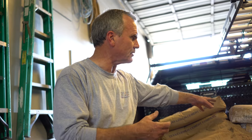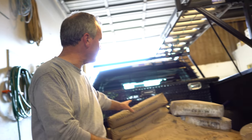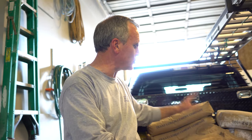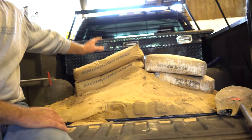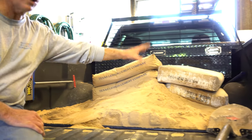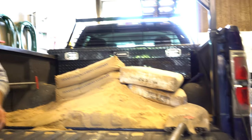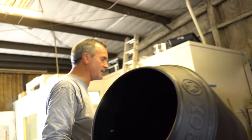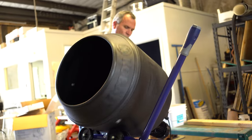For example, if it's concrete, they're going to have limestone and gravel in it, instead of just lime. We're going to be mixing Portland cement with lime, and the ratio is quite important. What we're going to be doing is 12 shovels of sand, 4 shovels of cement, 1 shovel of lime. Now, what this gives us is a Type M. We're going to start mixing this right now, turn on the mixer, and start mixing some sand in it. It's already got a little bit of water in there.